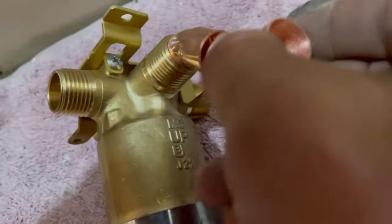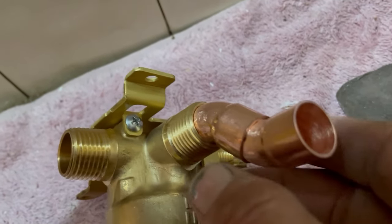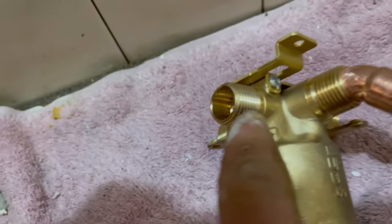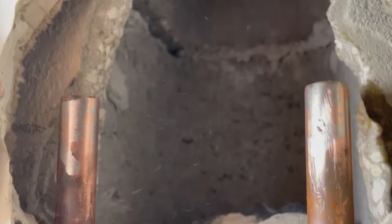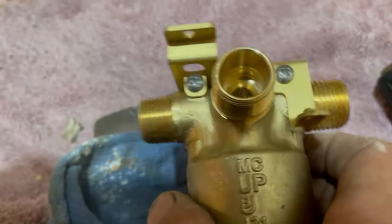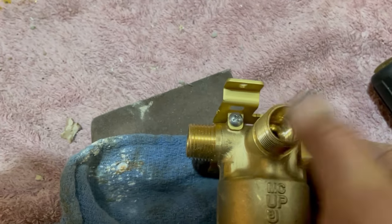This is obviously going to the shower head, and hot or cold. We don't have a tub, so we're going to be capping that outlet. With the old valve removed, what they had done is offset 45s in order to get the valve to sit just right coming out of the wall to catch the shower — and that's what we're going to have to recreate, as well as some half-inch copper street 90s coming off the hot and cold. Let me go ahead with a wire brush and clean the inside of the hot and cold sockets. We're not worried about the bottom since this is shower only.